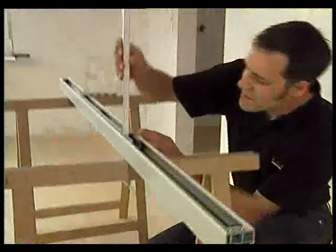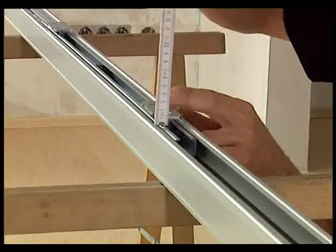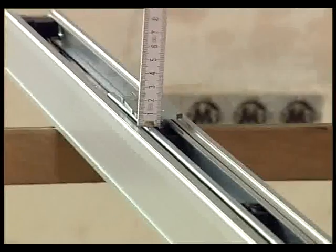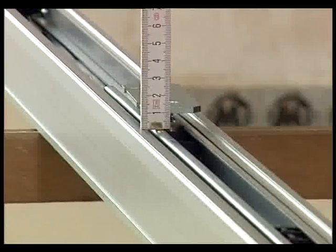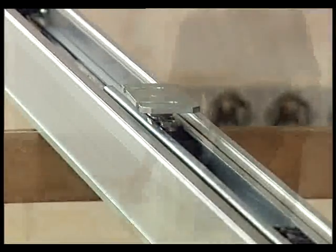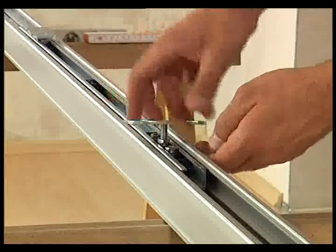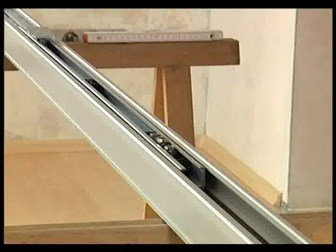The next step is to turn the threaded door panel connections at the operator until the clearance between the carrier and the door panel connection amounts to 10 mm. When using dorma-cs80 single-point fixings, like in our example, you do not require the door panel connections. It is essential to unscrew and remove them at this point.